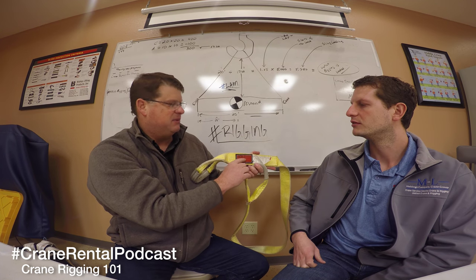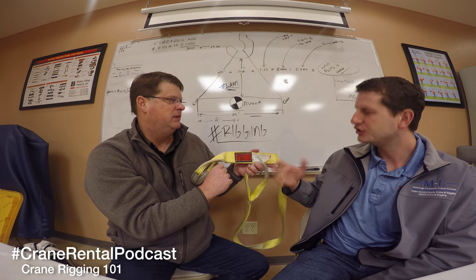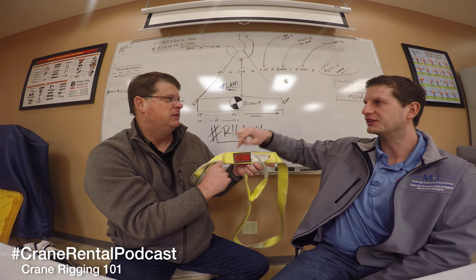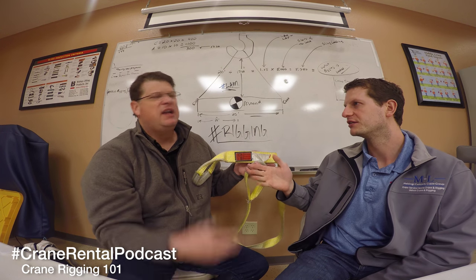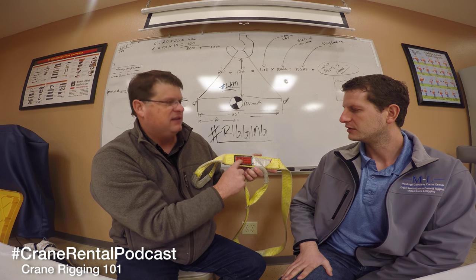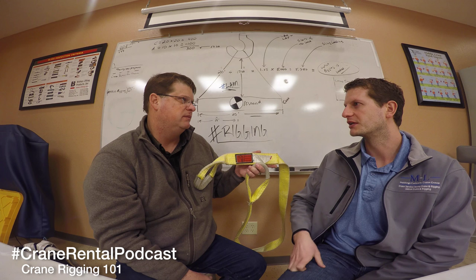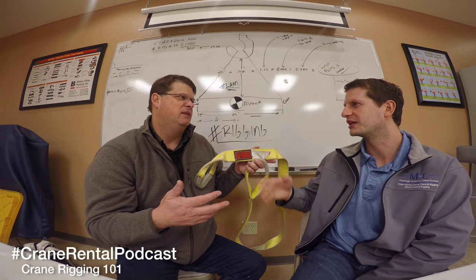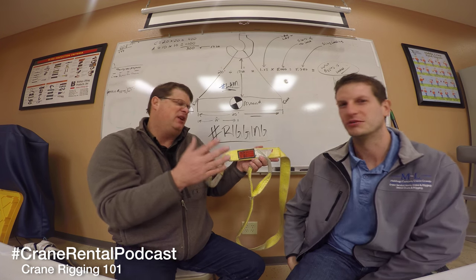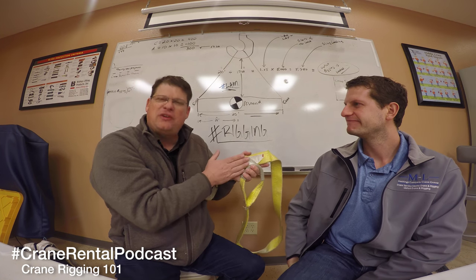We can only fill this eye up one-third the eye length without blowing it out under capacity. Other things to look for - UV damage, especially here in the Southwest. There are ways to check for UV damage. On a synthetic flat web sling like this, UV damage will turn them a gray color generally speaking. You can also hit them against a solid surface and if you see dust fly out, that's a sign of UV damage - because it's degraded the fibers internally, so they break apart and come out in a dust form.